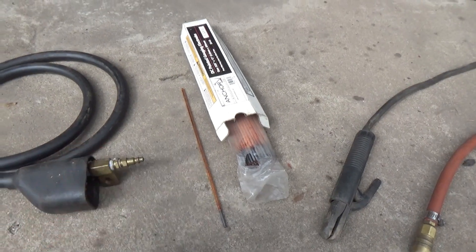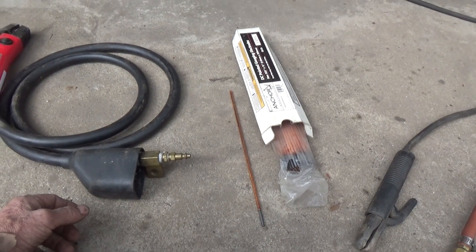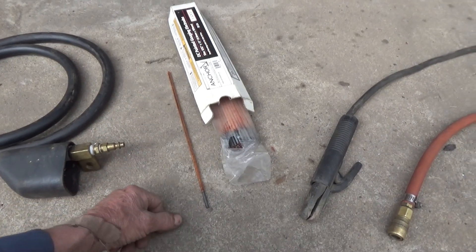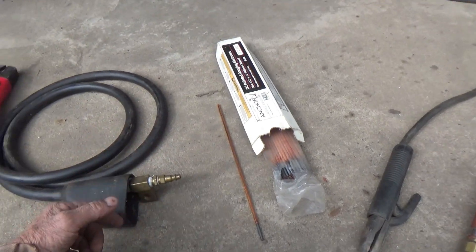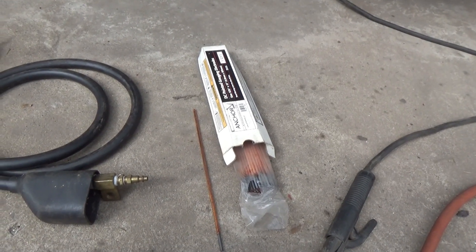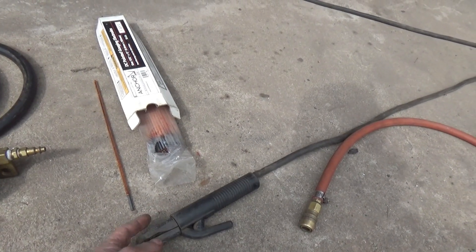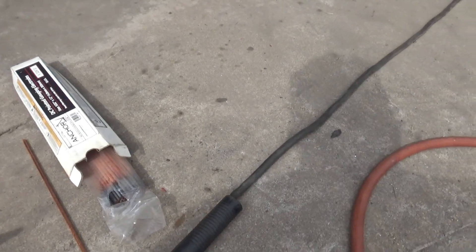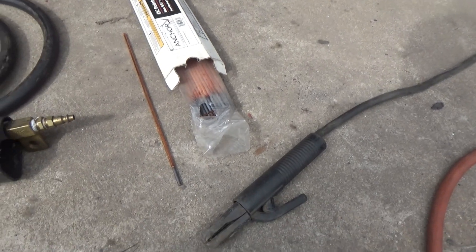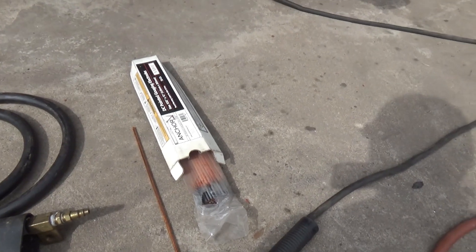When you're in an industrial shop with three-phase machines, large machines, you can use arc rods about the size of my finger and use six, eight hundred amps of power. I'm only going to push about 200 amps of power DC with an arc welder, so most home arc welders really don't have the power to do this. But I do have a larger arc welder, probably one of the bigger ones that you can get for working in a house.